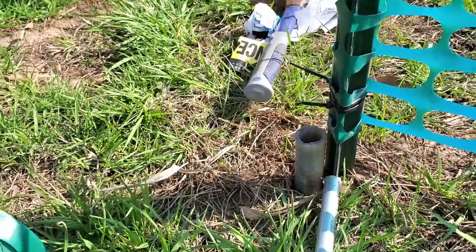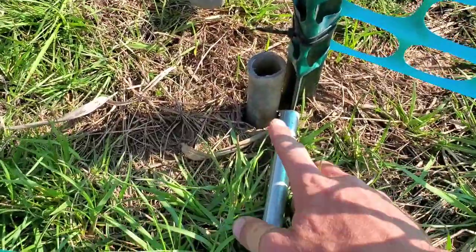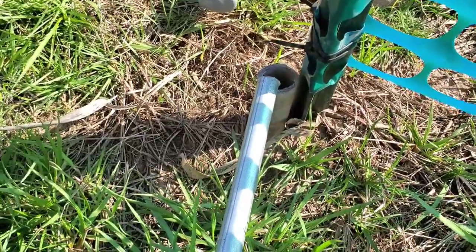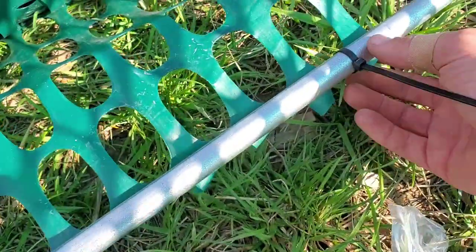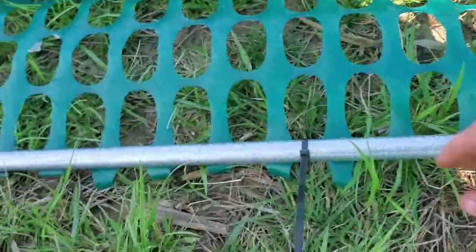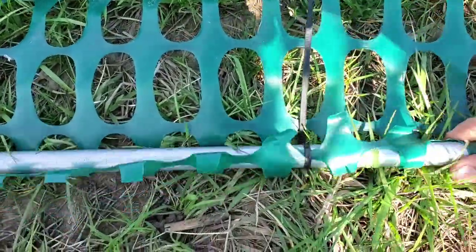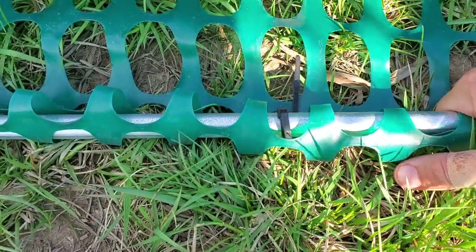I'm at where my gate's going to be — it's my last post on my first run. I drove a piece of pipe in the ground, a piece of top rail I think, big enough to fit my piece of half-inch EMT conduit into. Made a little mark how far it goes down the hole, and then I zip tied it in three spots just to the end. Then I'm going to roll it over twice, and zip tie it along its length in about five spots.